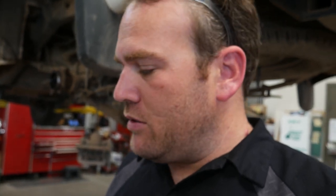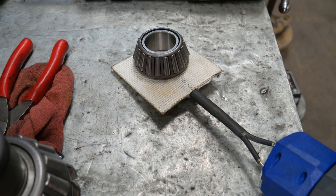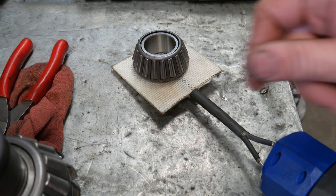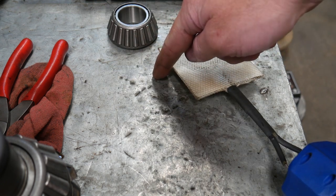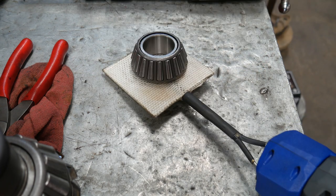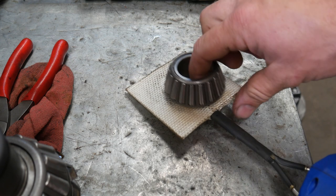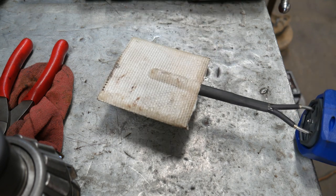This little plate is going to heat up metal things on both sides of it. So let me flip the camera around and show you what we're working with, and I'll show you how easily it works. If I were to lay this flat on the bench and put the bearing on top of it — like you would normally do for an inductive cooktop or even a hot plate — it's going to heat up the bench. This is a metal covering on top of a wood bench, so that could be bad. We don't want to burn our bench down or the shop down. So that's not going to work. But if I just flip this over and lay this on top of the bearing, I can easily heat that up.